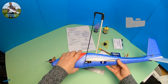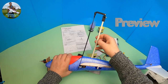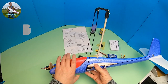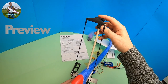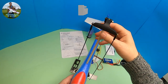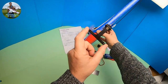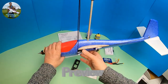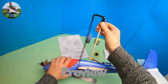I've glued the mast into position — this fiberglass rod has been epoxied in and that is strong. Prior to doing that I fitted the head on, drilled a hole through and put a bolt in, lined up so that while the glue is setting I can put it in and make sure it's set at 90 degrees — level — and checked everything was set up. When that was done I took it off and glued it in position.